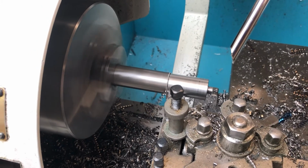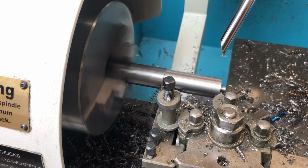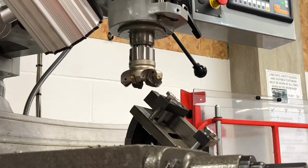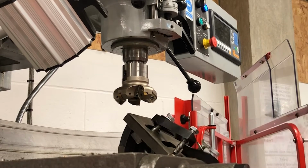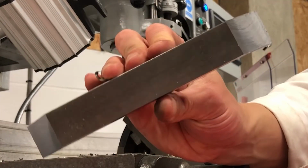I learned that when using these machines to remove material from solid metal, it's essential to perform incremental passes of around 2 millimeters. If you attempt to cut away any more than this, you risk damaging the cutting tool of the machine or shearing the part you are working on. To ensure you incrementally increase these passing cuts accurately, I learned you must first use the control panel of each machine to zero the cutting tool in relation to the part you are working with.